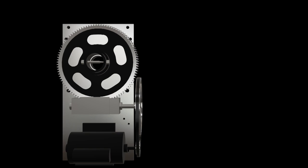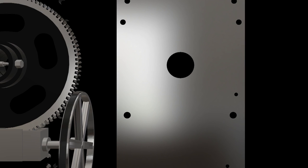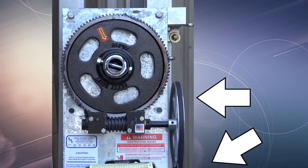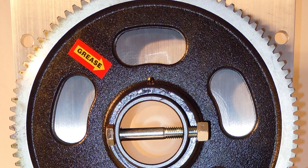If the hole in the plate is worn and excessively out of round, tightening the collar will not correct the problem and a new plate will be required. If the bull gear does not have a wobble and the problem is instead overload, take some pressure off the plate by using a larger drive pulley or a smaller motor pulley. This is very effective, even for misaligned units.